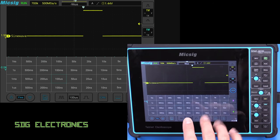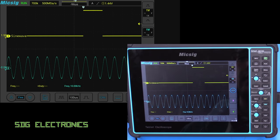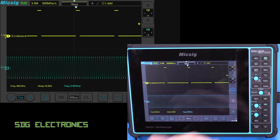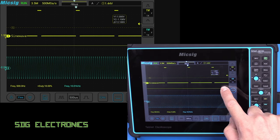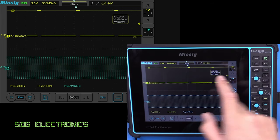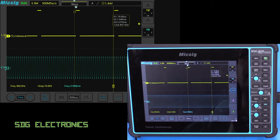A nice thing is that if you press the button in the middle of the time base, you get a whole selection of time bases to pick from quickly, so you can very easily switch between them — for example, selecting one second to get a rolling display, then quickly moving to 100 microseconds to get back to a fine view. Then we've got a CHX button for whichever channel you want as the active channel. We've also got cursors — horizontal cursors that move up and down if you select in the right place. You automatically get measurements here, such as peak to peak around 2.98 volts. Vertical cursors work the same way, giving basic measurements on screen very quickly.